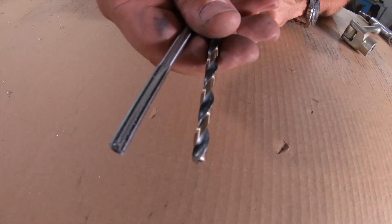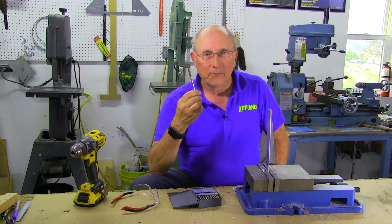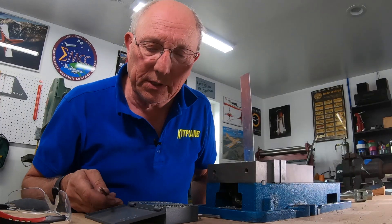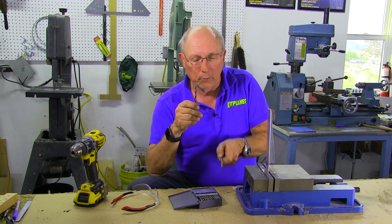It has just a little bit of a taper on it, so you'll want to use a drill bit which is just a little bit undersized. Fortunately, we have our drill index here and the largest drill in that is a number one, which is just slightly smaller than a quarter inch. And we have here a quarter inch reamer.